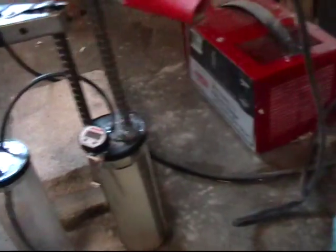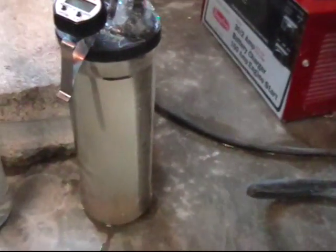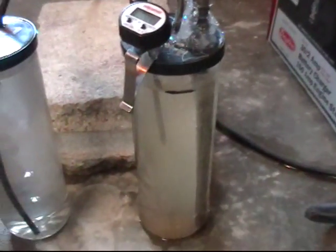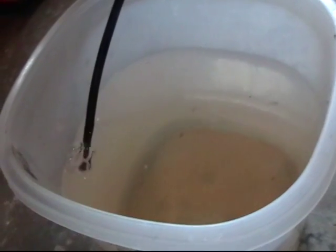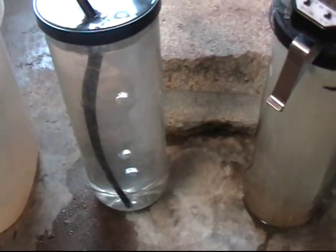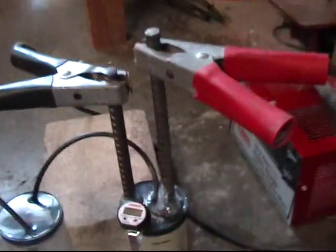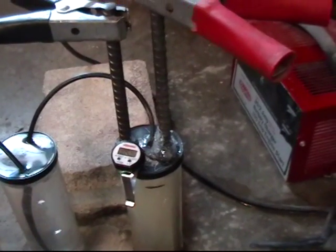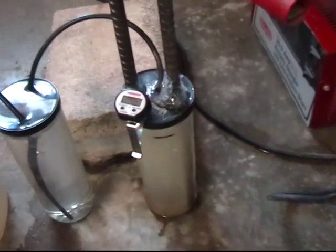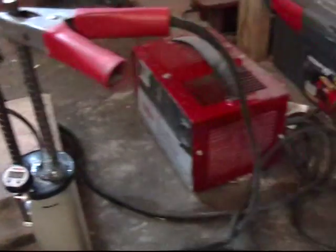Let's go ahead and turn it on — 12 volts and 2 amps. You can see it's starting to fog up; there's the hydrogen. Here's the bubbler. I don't have this sealed yet because it's kind of temporary, but we can pull the tube up and start to see some bubbles coming up. Let's go ahead and go with 30 amps to start making it a little faster. The bubbler's going faster now. Temperature is about 104.5 — takes a little while to heat up. I had it up to 147; it's a small area so it got a little too hot for safety, so I had to shut it off and let it cool down. Now that we're making hydrogen, let's go ahead and pop some of these hydrogen bubbles.